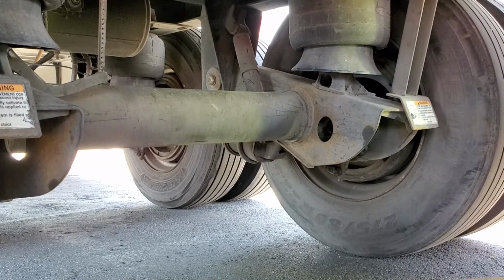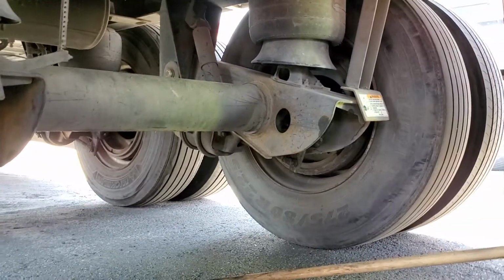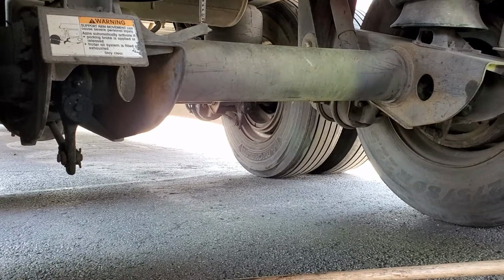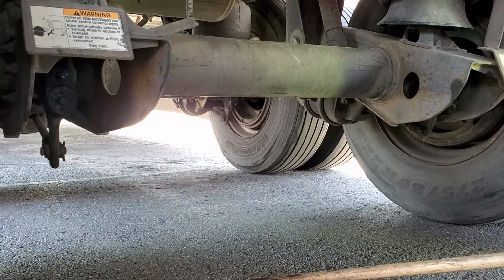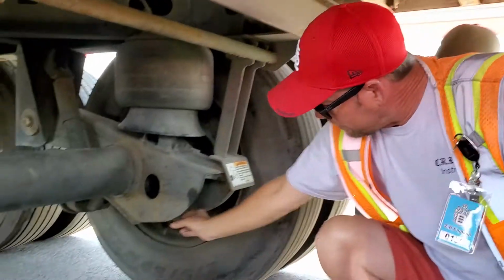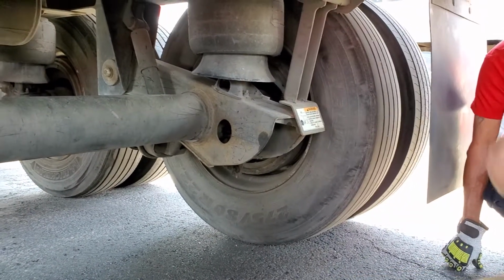That's fine. So when it talks about pulling on it to see if it moves an inch or not, where do you pull? Right here. Just like, if I go in that truck and push that red button in, this right here is gonna go forward about this far, give or take, depending on how much stuff you have. After it goes in, if I can take my hand and do this, it's loose. So therefore, I have to adjust it.